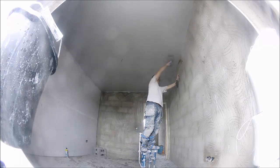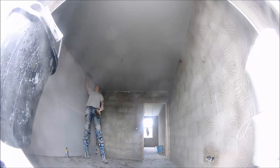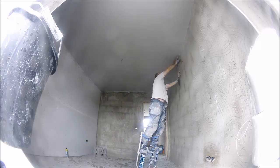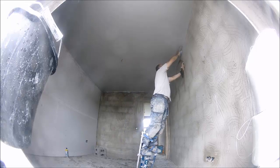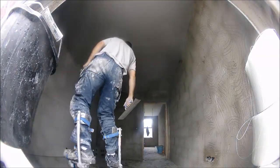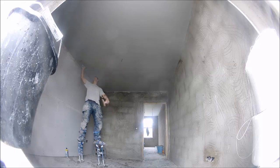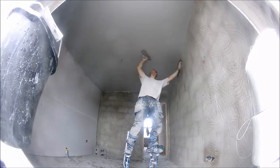You don't want to over-trowel either, otherwise you'll end up with different problems. At this stage you can see I'm walking it and wetting it quite a lot — it does need a bit more water and I have my trowel at a sharper angle for a bit more cut. At this stage you really must have no holes and no lines — you have to have the ceiling pretty smooth and flat. Keep your trowel and tools clean between trowels. If you're working around a light fitting, just chase it around the light until you're on the other side.